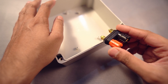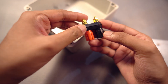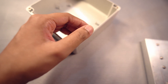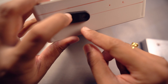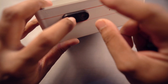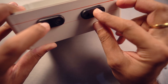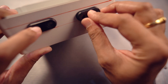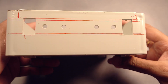The next step is fixing the banana jacks. I did the markings for the holes — it's pretty easy. You just take out the two plastic brackets and hold them to the place where you want to make the holes, then mark it, draw straight lines across, put another one and mark again. Also measure the distance on both sides to make sure it's the same. I'll drill the holes and come back. I made all the holes and slots required.